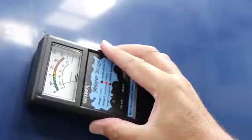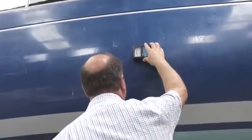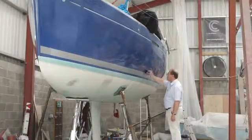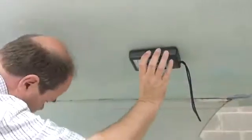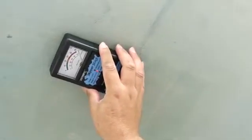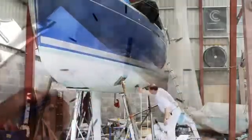When you have finished, you should have a table looking something like this. Readings lower than about 14% or in the green are ideal, and show that the laminate is dry. If you can, this would be a good time to protect your boat with some epoxy. Slightly higher readings, up to about 18 or 20%, might be found if the boat has just been lifted, and are no cause for alarm, but the hull should be allowed to dry out before considering any epoxy treatment. Readings above 20% might indicate a problem in the laminate, or could be caused by bilge water and condensation. If the laminate has started to become osmotic, there is not much that can be done at this stage, but wintering ashore will delay the need for a full treatment.